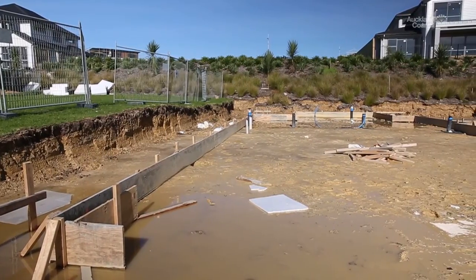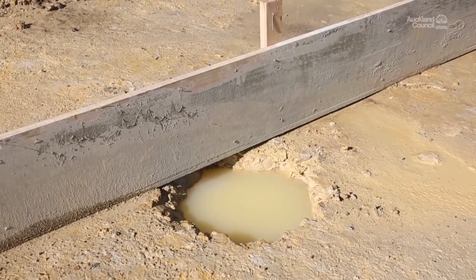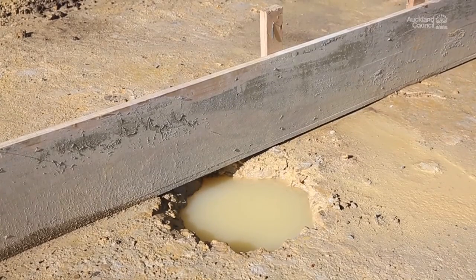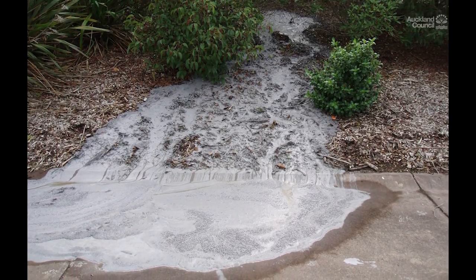It's very important to never schedule your concrete pour for a rainy day. Pick a day like this — it's better for the job and for the environment. If you're going to do a concrete pour after it's been raining, make sure you remove water from pile holes, footings and foundations before pumping concrete. That way, concrete-laden water won't spill over and go down the drains.